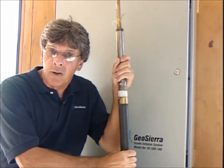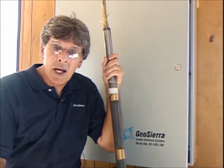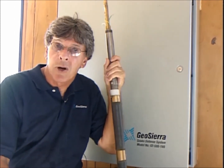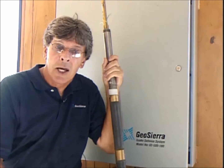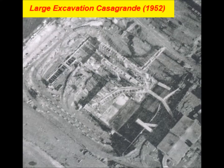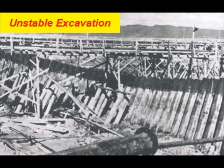Now, over 50 years ago, a guy called Leo Casagrande discovered electro-osmosis potential for stabilizing soils, and he showed it. This is full scale. They were done in World War II to start with, and then in the 50s and 60s in Canada and the United States. What happens, you put electrodes in the ground, and if you've got a slope and you apply a DC voltage, it can stabilize it, and it stabilizes immediately.